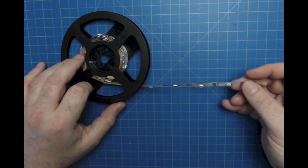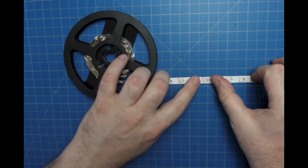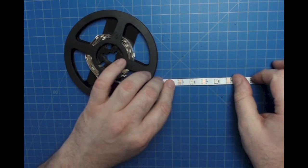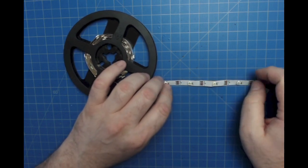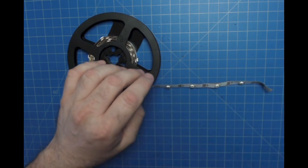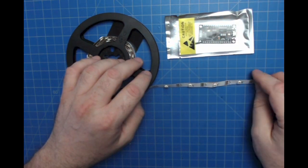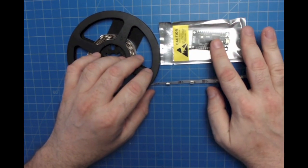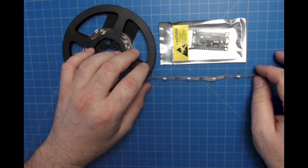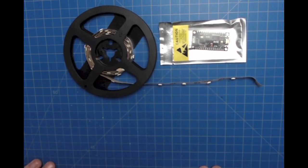One of the structures we'll be building for Light Forms is the 8x8x8 LED array. And then there are several options for different structures that can be built around the flexible LED strip setup — including forming them into a cylinder, covering the outside of a cube, or creating a really nice fireplace effect. These can be driven with a microcontroller, and since this microcontroller is an ESP8266, it can even be controlled wirelessly over WiFi. There are some really exciting options.